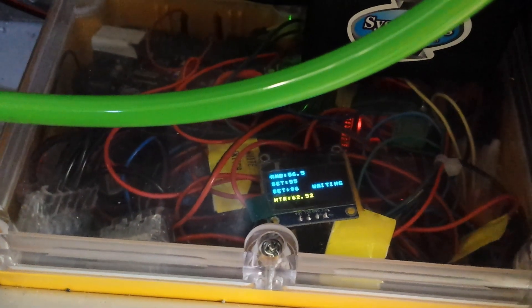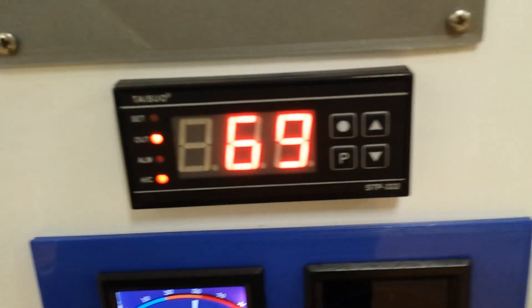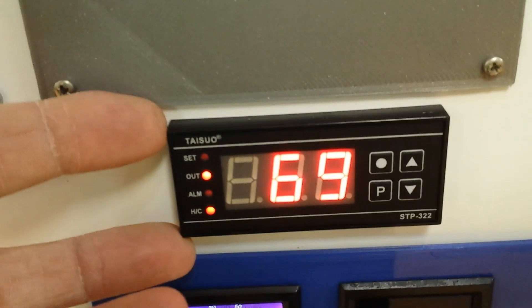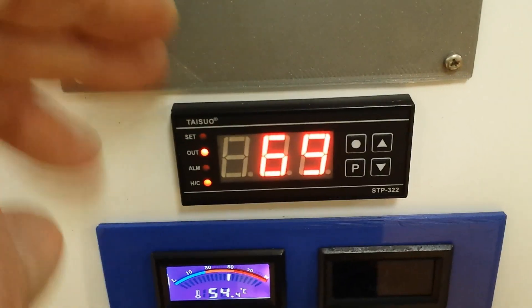I will change this and possibly purchase a dedicated controller, maybe a PID one. The reason I've left the Arduino in there is because there is a small PID program running that tries to hold the chamber heater at a nice temperature. With the Arduino Mega I can monitor several temperatures at once, whereas with the controller you can only monitor one. This temperature controller is purely set to protect my silicon heater, which is generally the component that will fail with heavy use.